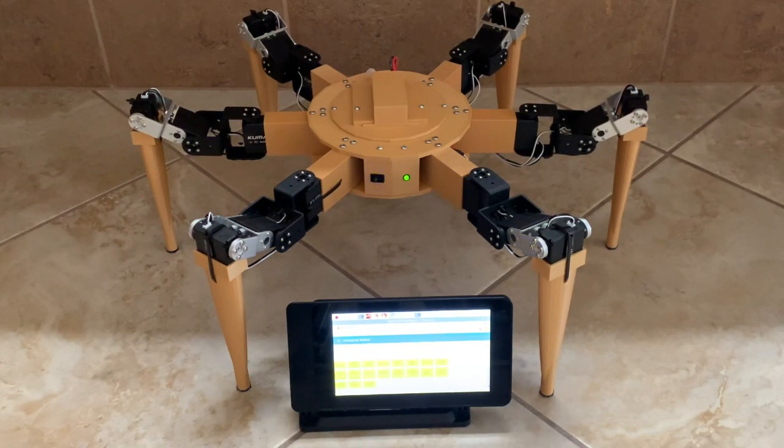The controller is a Raspberry Pi microcomputer running C++ code that I wrote, and it's contained in a case that holds a Raspberry Pi 7-inch touchscreen display. The code uses Node-RED dashboard nodes to create user-friendly icons to control the robot. The icons send MQTT messages to the robot using Wi-Fi, built on a Raspberry Pi access point, to the robot's ESP32.